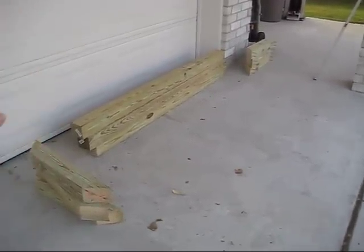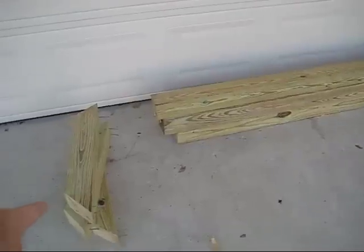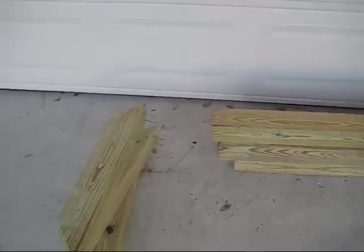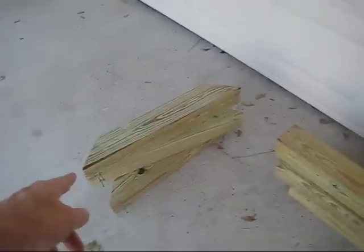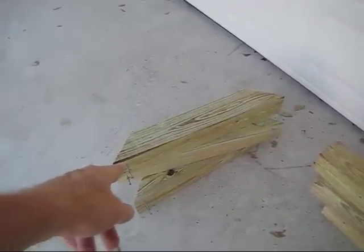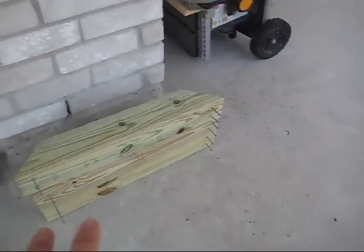The crossbars will be 6 feet long, so I cut two feet off the ends of these three boards here, which gave me three support pieces. I then cut these to all two-foot lengths, cut at 45-degree angles, so it's two feet length on the outside. I pre-drilled and put in three-inch galvanized screws, the same ones I used on the rest of the grow box. I've got those all set, ready to go.